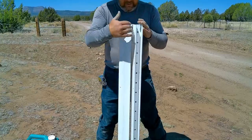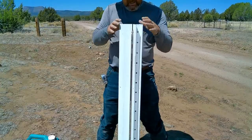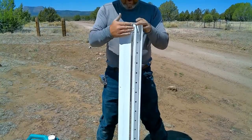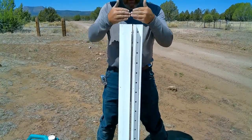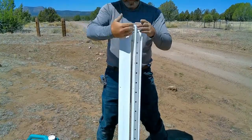If you were going the other direction, you would have to put the hinge on the inside. That's how we're doing an outside corner — hinge on the outside. If you're going to the inside, making your corner more narrow, you put the hinge on the inside.